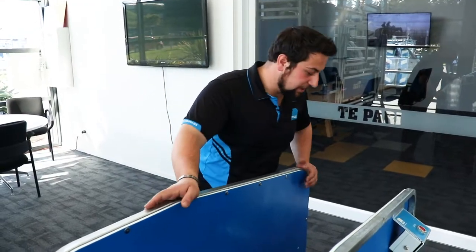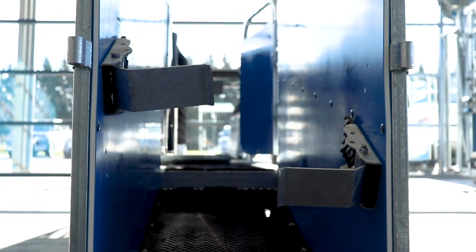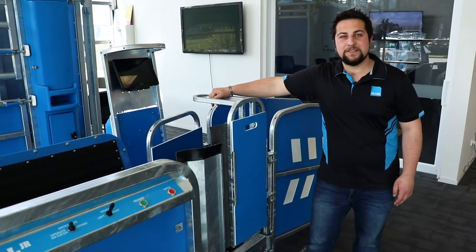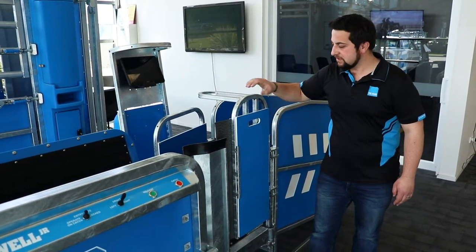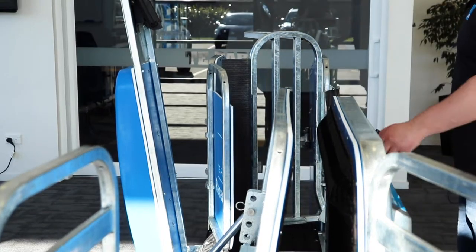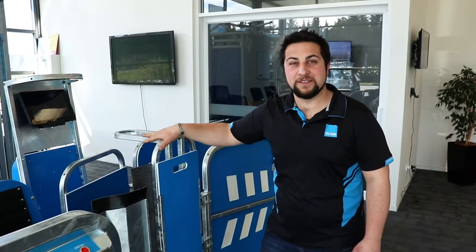Down in here you'll see spring-loaded backing flaps which have replaced the automatic backing hook. Next, the auto gate. This actually hasn't changed — same across all the models. It still has the removable flap so animals can see right through the machine. This helps with animal flow through the machine, and the gate is still pneumatically operated from a ram on the underside of the gate.